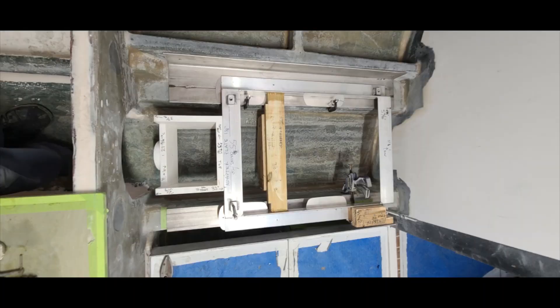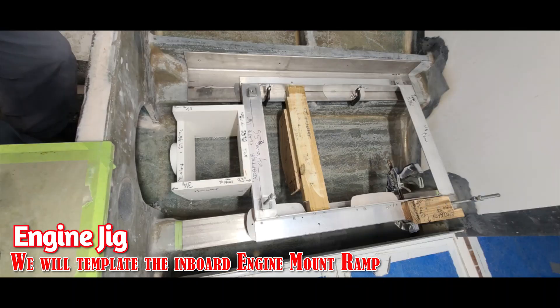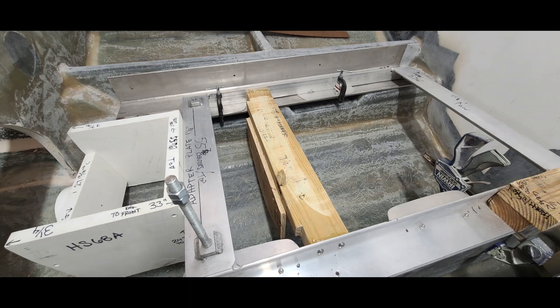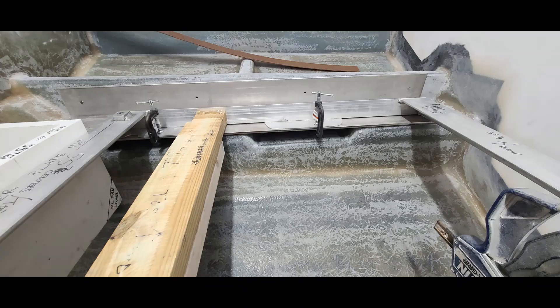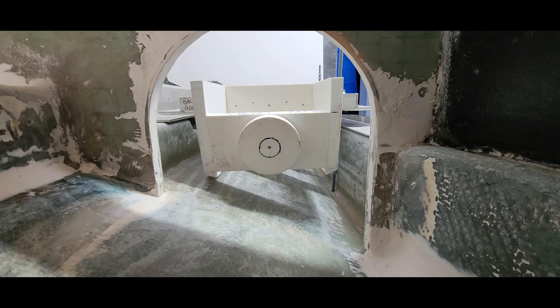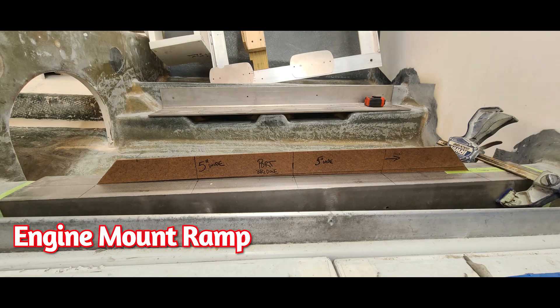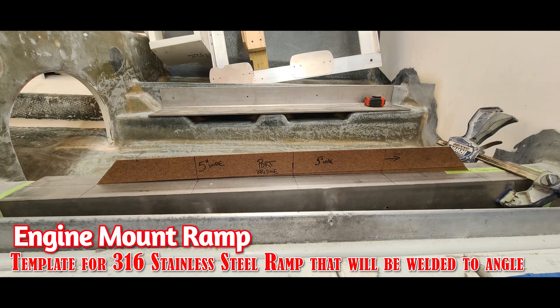Here's the engine jig. The purpose for setting it in at this point was to set it on top of the outboard engine bed and for us to template the inboard ramp — a name we gave it because it's very shallow. Typically they're called towers, and this is anything but a tower when you see it. That is just showing the jig directly on the center line of the core engine. That aluminum plate that's kind of curved with the C-clamp on it is the footprint of the isolator, and there's the ramp — the template for the ramp. Each one of those vertical lines will have a web.